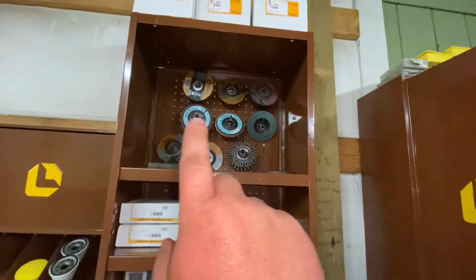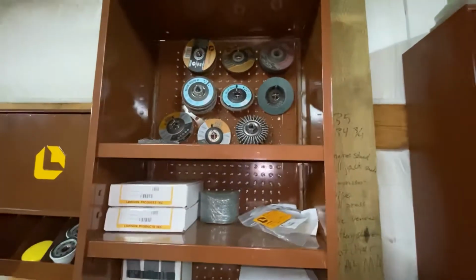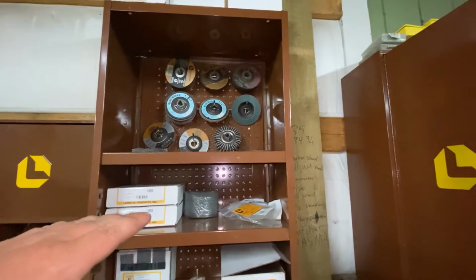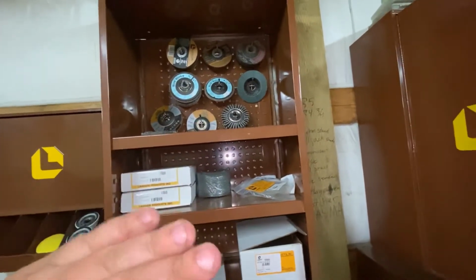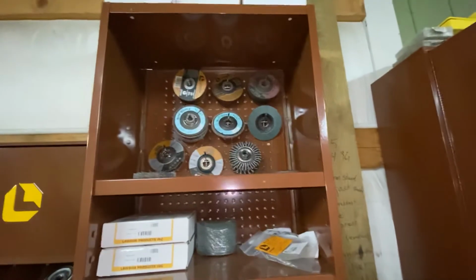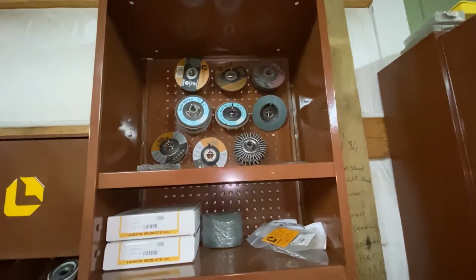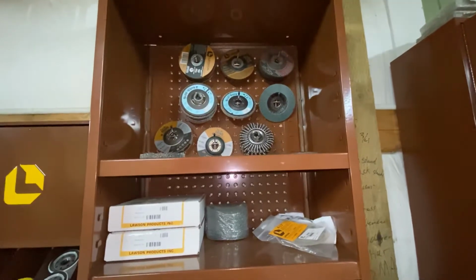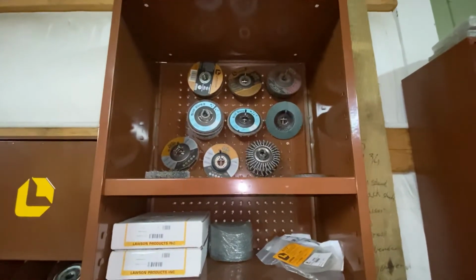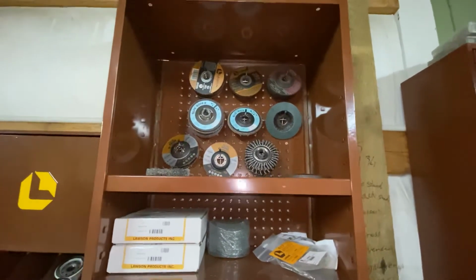And the thicknesses of them. Not that a lot of the times the thickness of a cutting wheel is that important, but when you're doing body work, sometimes it is. And if you're willing to pay double the price for a disc, it is 3 or 4 times better than the bargain basement ones. I won't even buy grinding discs at Harbor Freight. I've had a couple bigger ones explode on me with very little pressure. It was a 6 or 7 inch disc for one of my bigger grinders. I was putting very little pressure on it, and it just shattered. It wasn't even cutting anything out of the ordinary. It was cutting tubing.